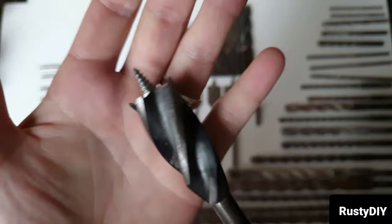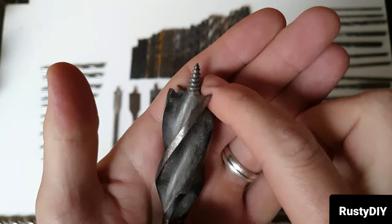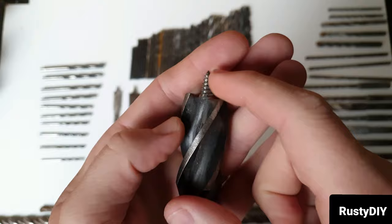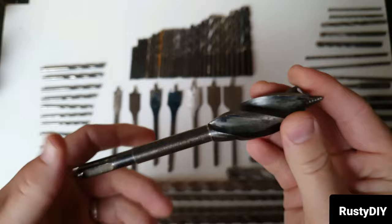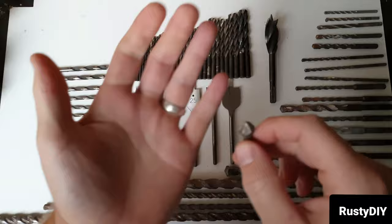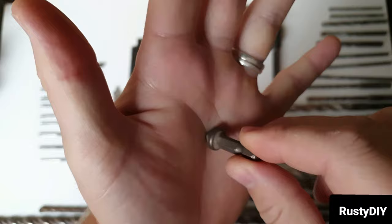The next wood bit is a quad flute drill bit — you may also hear them called quad flute auger bits or just auger bits. You can get them with more or fewer cutting points and flutes. They have a corkscrew so they pull themselves in really nicely, and the deep grooves help remove the timber being chipped away. They give you a really good hole, but they're not very novice-friendly — if you catch a knot or a nail they will stop and throw the drill around in your hand, which can really hurt. This one I have here has an SDS chuck end.